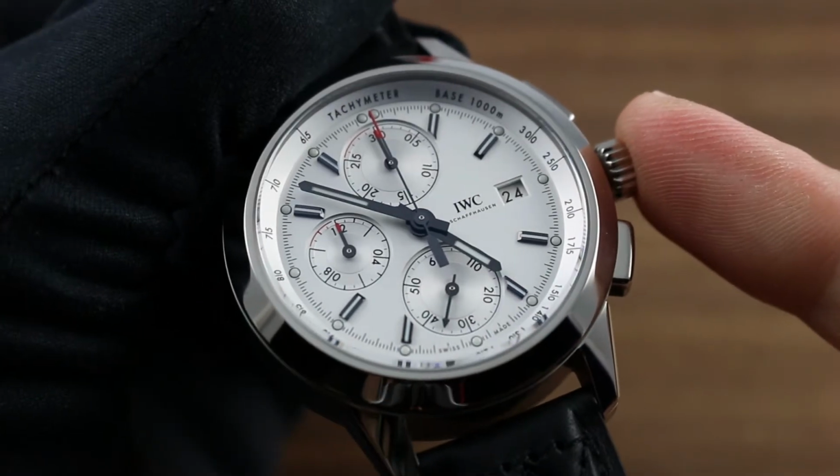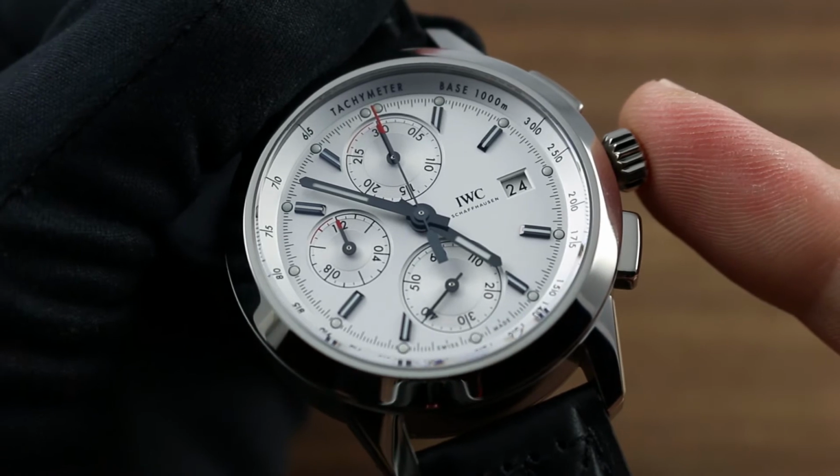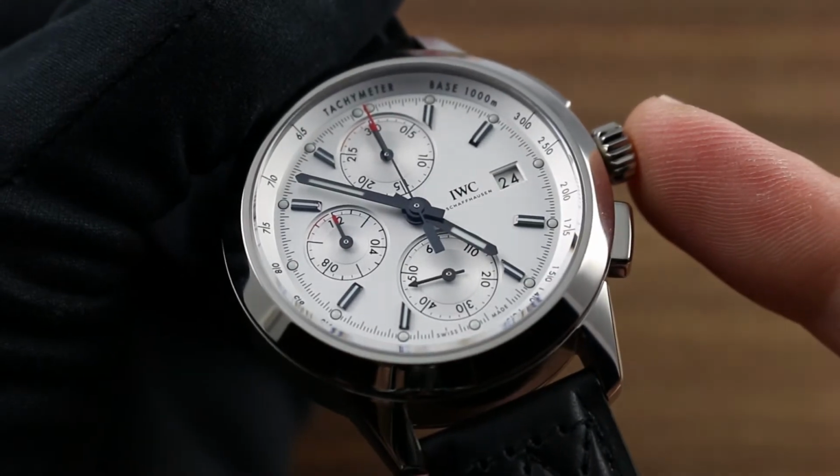Take note, because of the bridle style mainspring, you cannot accidentally overwind the watch. The bridle simply slips to relieve any excess strain, and that tick or click you hear will be the bridle slipping, your sign that the watch truly is fully wound.